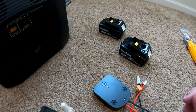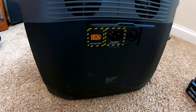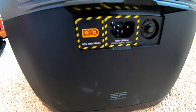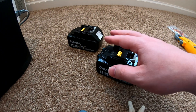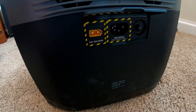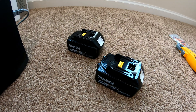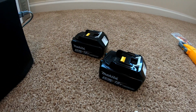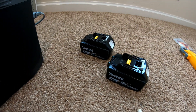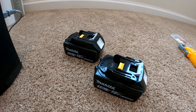So we're going to connect these batteries in series and double their voltage, which will actually dump a lot of energy really fast into this unit. Make sure — just as a safety note — that you don't exceed whatever the voltage rating is on your power station. In this case for the Delta 1300 it's 65 volts. These batteries when connected in series and fully charged are about 40 volts total, and as they discharge they'll go down. This unit has a voltage range of 12 to 65 volts, so that should work out just great. Also make sure that both batteries are charged equally, because if you put a fully charged battery next to a discharged battery there will be high current and you'll burn up one of your fuses. So make sure both are very close to the same charge level.